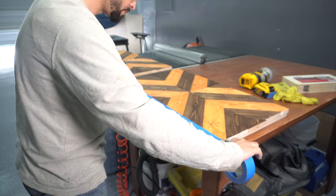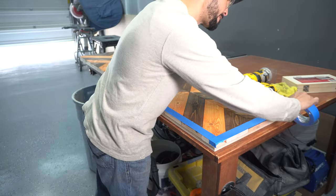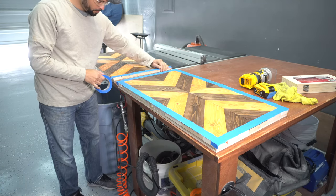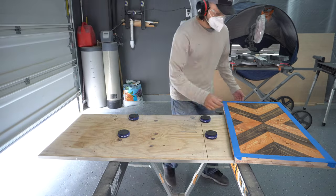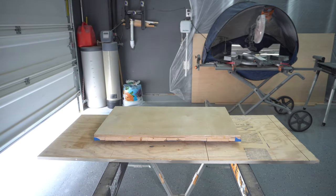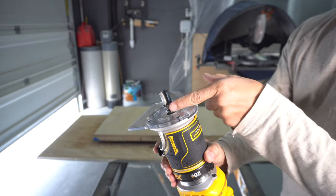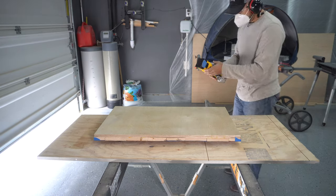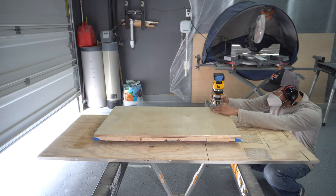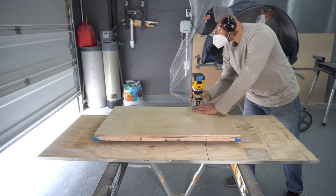I take some painter's tape and add it along the edge of the countertop. Since I'm going to trim everything to size, I want to prevent tear-out as much as possible. Since the bottom side of my countertop has the flattest board available, I flip it upside down on the workbench and grab a reverse flush trim router bit from my palm router, then I go to town. I take light passes across the board to prevent tear-outs — this can easily set you back a few days if you have to start from scratch all over again.